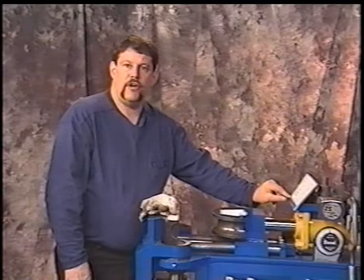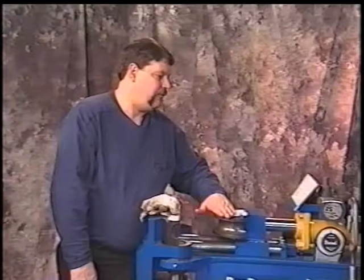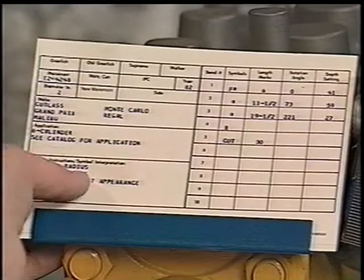It'll explain it further. Down below it says program instructions and symbol interpretation. You want to read that. It says use 4-inch radius die. You want to make sure your 4-inch die is in here. Star, it says use half shoe. Saw cut rear to suit appearance.